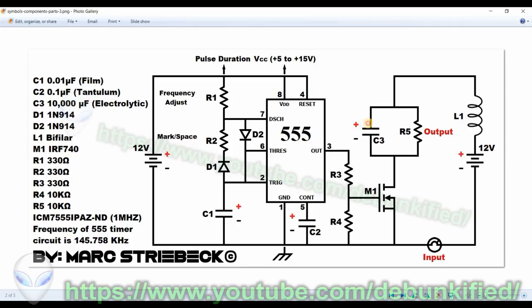C3 is an electrolytic capacitor — I have a 10,000 microfarad capacitor there, and that value isn't critical. The load resistor R5 is 10,000 ohms. This is the smallest resistance I've found that pulls the current out of the micro range and into the milli range, which is helpful so we don't have to account for tiny current leakage from the capacitor or the meter consuming microamps. Now we can get about 1.23 milliamps running through the circuit.